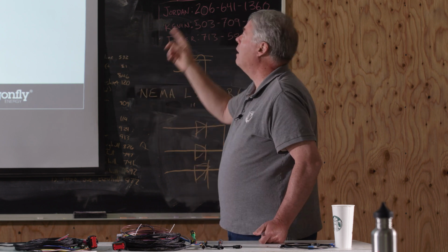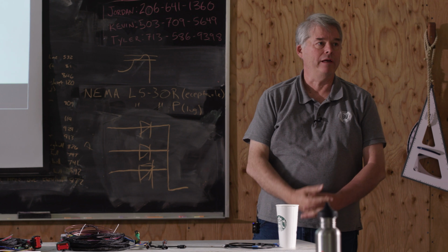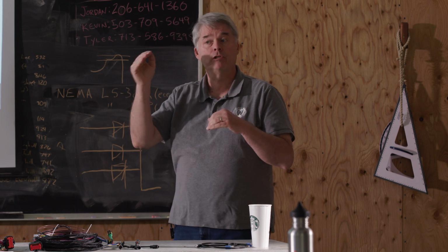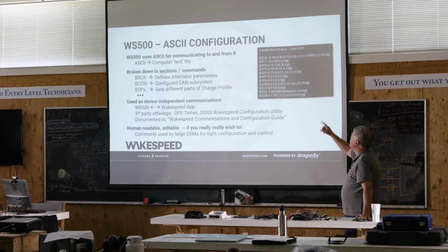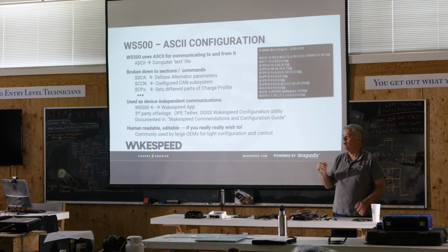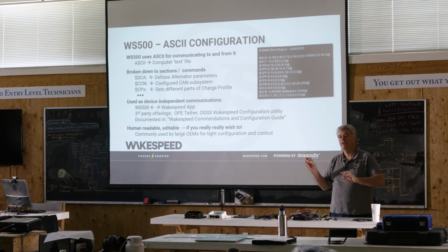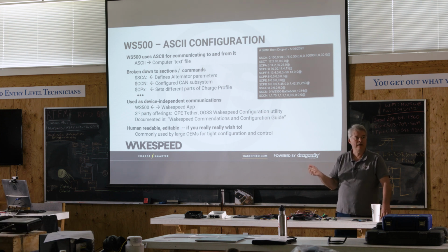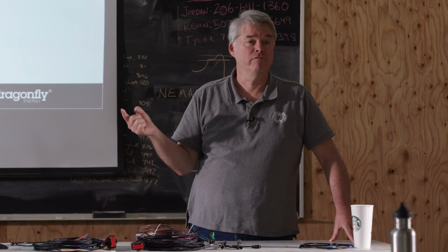You can define it. I will also tell you this is set up for a 0.5 C rate. So we're going to limit battery current to that battery at a 0.5 C rate unless we get at temperature extremes. If we're from 42 to 45 degrees C, we're going to run this at a 0.05 C rate. It's a way for the regulator to slow things down as the battery starts getting stressed. Now we purposely had a choice to either leave that line active or to have it also ignored when we're in a slave mode. We chose to leave it active because sometimes system installers may say, I don't care if the battery is rated for a 0.5 C rate and wants a 0.5 C. I don't care if the battery is asking for a 1 C.